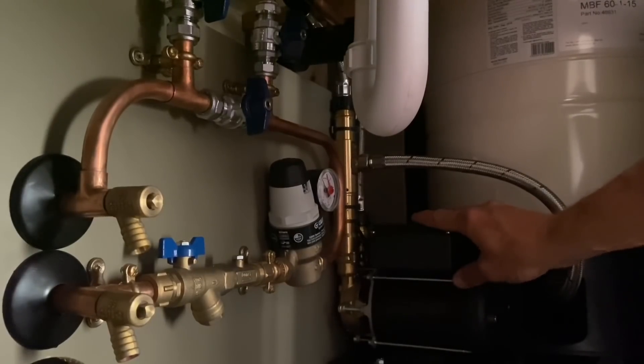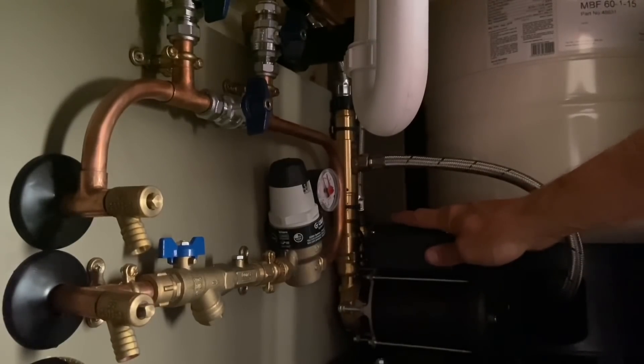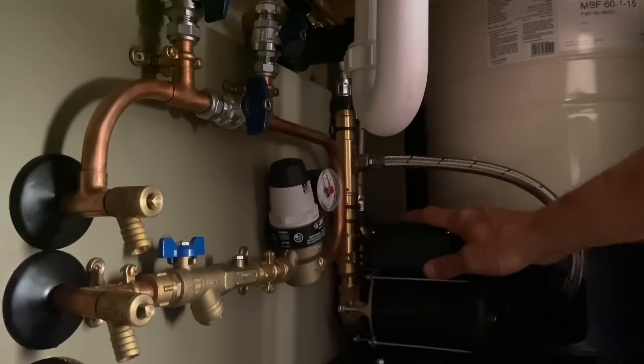By water regulations, the pump is set to a maximum of 12 liters per minute. On this job we've got 9 liters per minute coming in, and the pump will deliver a maximum of 12 liters per minute — but it won't bump us up from 9 to 12. You can't pump more than you've got; you can't pull extra water out of the main. What it will do is increase your pressure — this pump adds 1.5 bar. So our current 1.7 bar plus 1.5 gives us 3.2 bar.